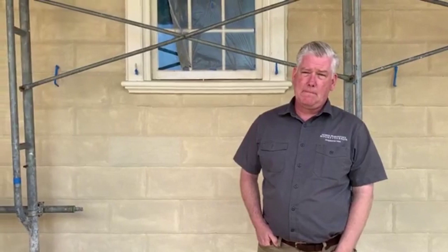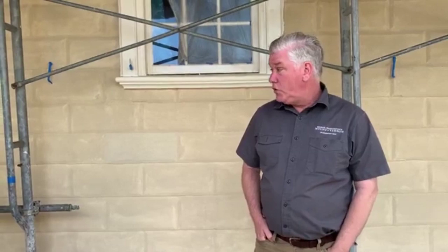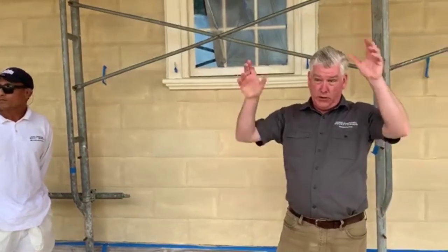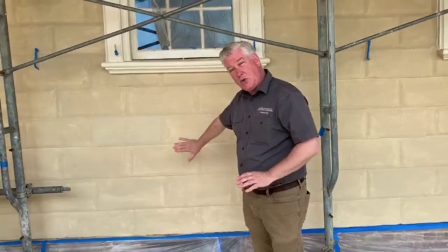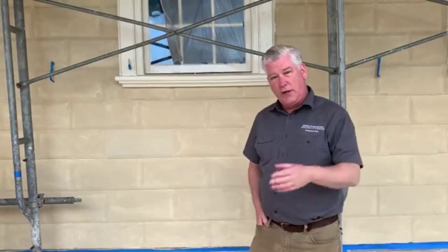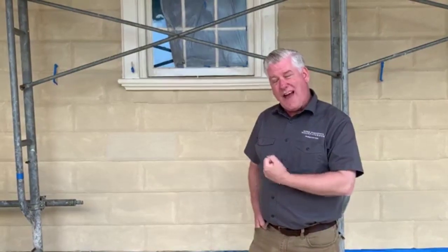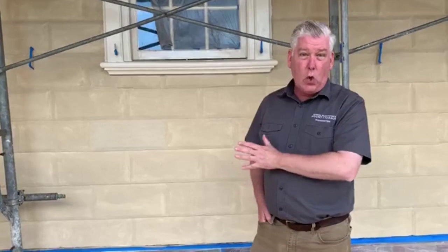Some people who joined late want a reminder that this is wood being covered with sand. And somebody asked what is holding the wood in place. Just like almost any house in America today, this is a frame house — you build a frame using corner posts and studs that make up the wall, and then the boards are placed up against those wooden framing members and nailed in by iron nails. Those nails would have been made in England; Washington bought hundreds of thousands of nails that came over in kegs, and they were used to fasten those siding boards to the exterior of the house's wooden frame.